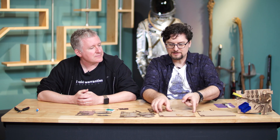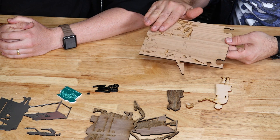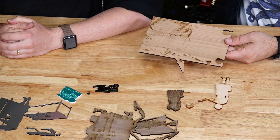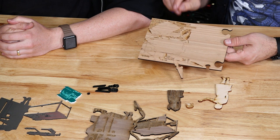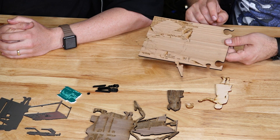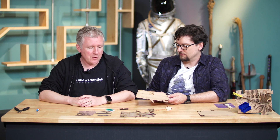When doing wood especially, you want some kind of protection over the top — like masking tape — to prevent scorching. We just don't have any big masking tape right now, so the scorching is minimal, but I'm going to hit it with just a little bit of sandpaper very lightly to clean it up. That really does get rid of it.